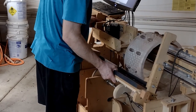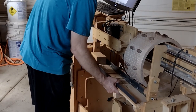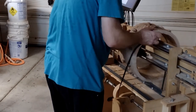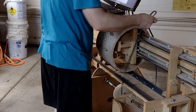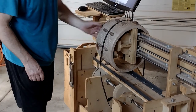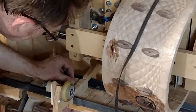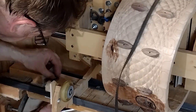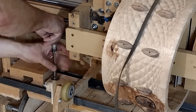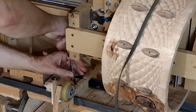Now that the drum is around the gantry I will put on my spinner cradle — I don't really have a name for that, but spinner cradle is probably as close as anything. It hooks on the rails, and once it's in place I will put some clamps on each side so that it holds it nice and sturdy with no movement left or right or front to back. And now I'm adding the spinner wheels. I've got a plate with T-nuts in the bottom that I will screw through so it holds in place, and I can adjust it back and forth left and right with those screws and tighten it down when I'm happy.